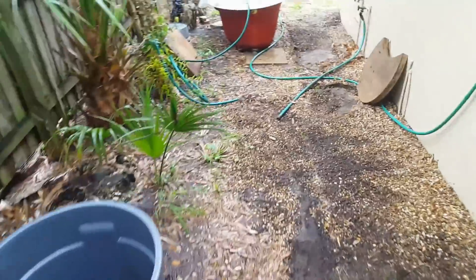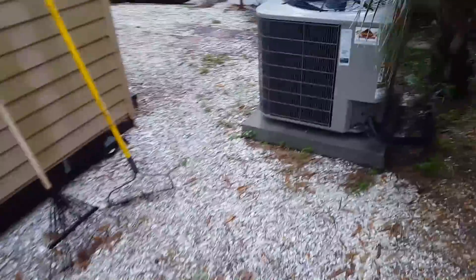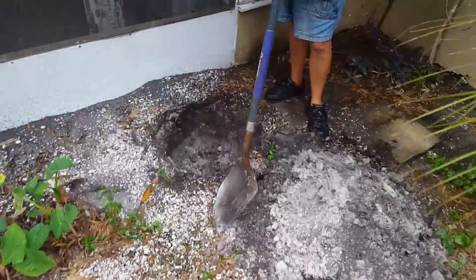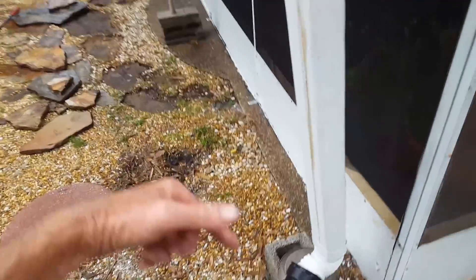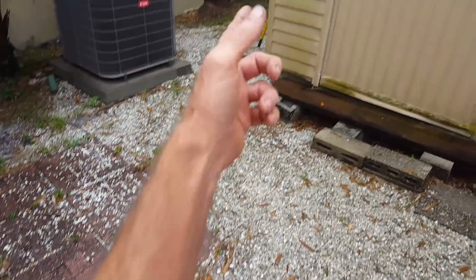Another section will be to put the sump pit in. We've got Dan over here digging the sump pit — he's almost done. It's really a simple job here in the sand. Then another guy is going to dig the footer tiles as they run around, bring that into the sump pit, plumb that, and then discharge right out to the street.